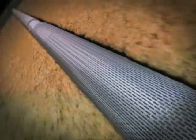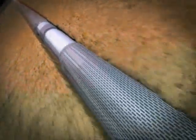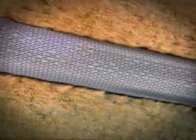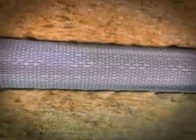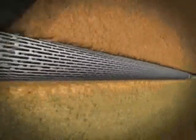Weatherford's ESS technology offers superior sand control capability while supporting the well bore, including use in non-uniform, high fines environments. Compliance expansion acts to stabilize the formation and present it with a large filter surface, which reduces plugging and provides a low skin — positive contributions for improved productivity and injectivity, and all leading to enhanced reservoir recovery.